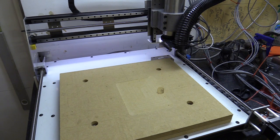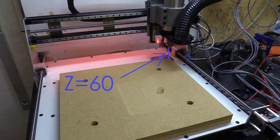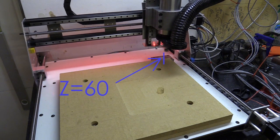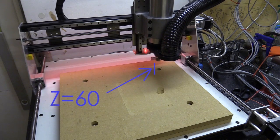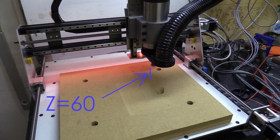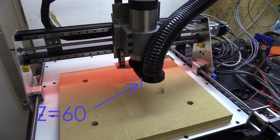I started to troubleshoot the problem, setting the Z0 height 30mm above the wasteboard and trying different things to stop the job to see if I could pinpoint where the problem was. The controls on the enclosure worked fine, and it turned out to be software. I had accidentally set the control software to Imperial while my jobs were set up in metric.